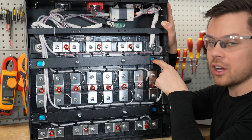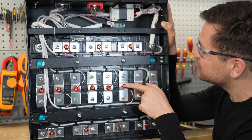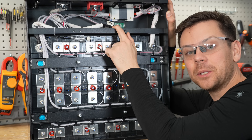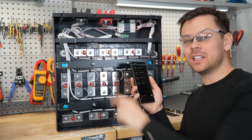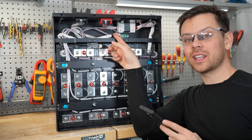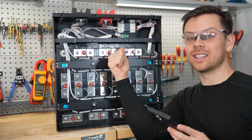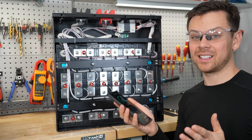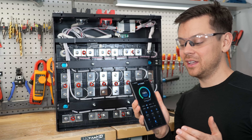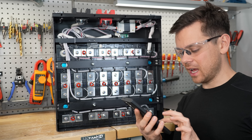In this channel, there are holes for the overpressure relief valves. The screws and nuts are marked, and these are glued — everything up here is glued. It's really nice. Now, this is a JBD BMS, and it's very common. You can use their app or the JBD app. This is the same BMS that Overkill Solar sells, so a lot of DIY packs have the same BMS as this. I've built lots of packs — I have like a box of those things — and I've never broken one. So these are fantastic, very reliable, and lots of people use them. I think the Vatrer app looks better than the JBD app.